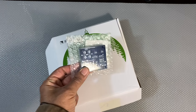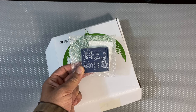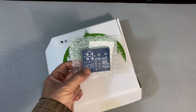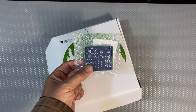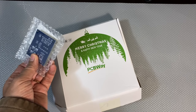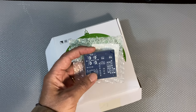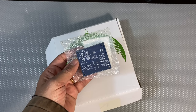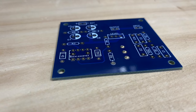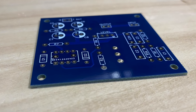And this thing is a buffer. Basically what this does is it receives the input, buffers it, and attenuates it if I want to. I've got various attenuation levels to feed it into the sound card — to reduce noise, and to avoid the risk of blowing up the computer sound card. I've just received the PCBs from PCBWay and I want to thank them again for sponsoring this video. I'm going to build this and describe what it is I'm actually designing. It's nothing too dramatic, nothing too new — it's been done before. I like the neat finish and I'll put it into an enclosure which will be shielded to get as little noise as possible.